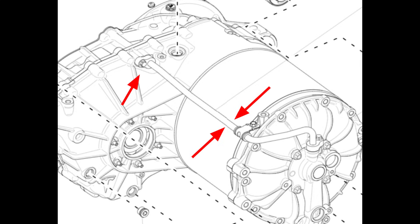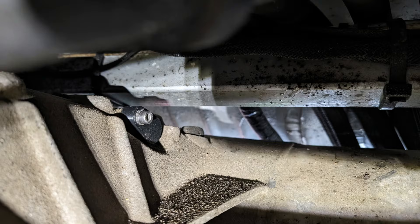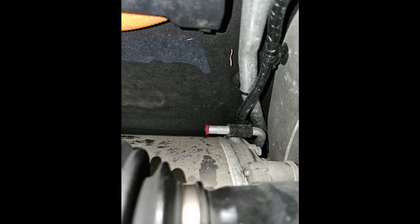When installing this kit in the car it can be difficult to access the outer fitting on the top of the coolant manifold. So the alternate installation method is to cut the coolant pipe near the hold down clamp, removing the inboard section of pipe. With this removed you can then install the dust cap above the differential, and it's also a good idea to seal off the remaining pipe with some RTV silicone to prevent dust and moisture from entering this now unused section of pipe.